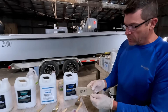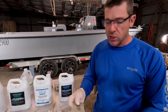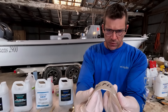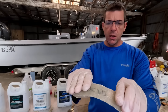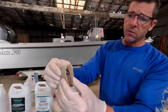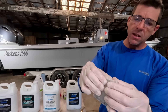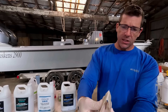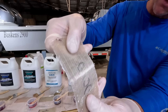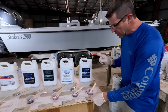Let's start the stress test. We laminated 1708 from the same roll and same batch with each resin. Starting with the DCPD — as far as flexibility, we've got good flexibility; starting to hear a little cracking when we really roll into it. I'm putting it under a load and I'm actually surprised — it's quite resilient. Even now the glass fibers, even though you've got a fault line, that held up actually quite well. So that's the DCPD Ortho Blend.